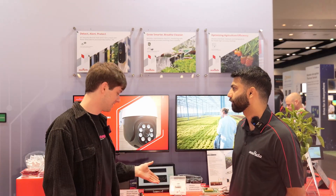When I see something really small like this, I think of all the applications in miniaturized, low-power devices. Is low power something that's been designed in mind here? Yes, of course — low power is one of the big driving factors. A lot of these are in battery-operated devices like doorbells. The component itself draws about eight microamps, with the electrodes in the nano-amp range. Where power consumption really comes from is waking up the MCU unnecessarily — false detections that wake up the MCU or tell the camera to start recording when it doesn't need to.